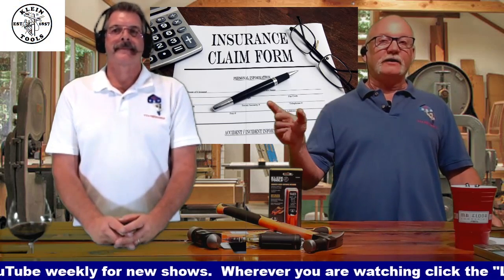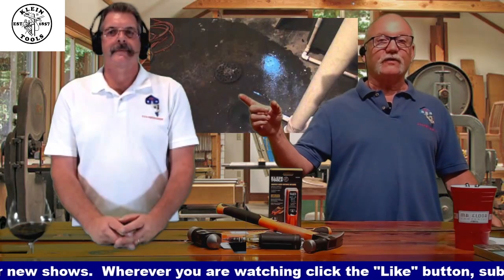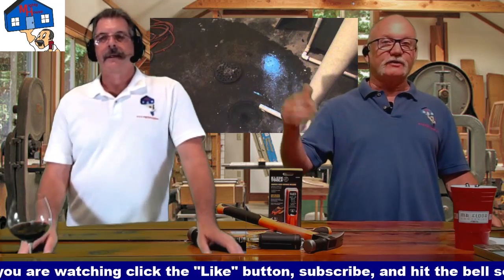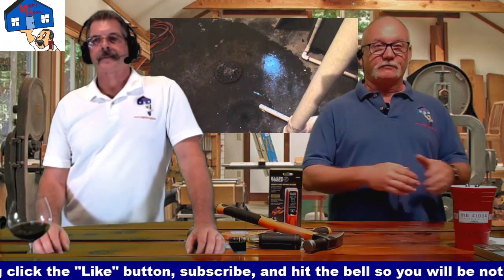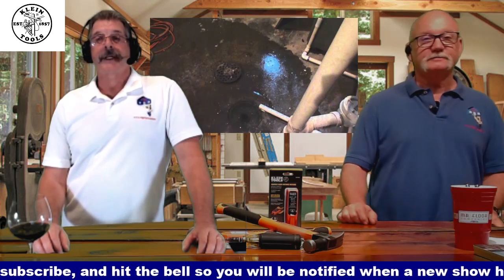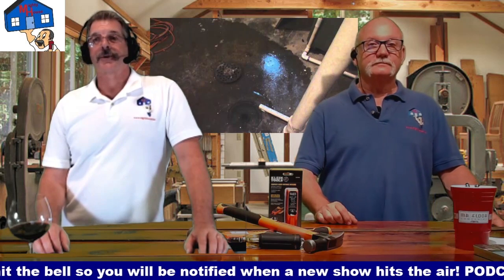And you might want to investigate it a little bit. What caused this leak? Was it a floor drain like Rich was talking about? This is combined with the sewers and the storm sewers outside. The streets filled up, and then your basement overflowed, and they used your basement as just a stormwater retention area. And I've seen that in Oak Forest. It was a rain event where the storm sewers filled.